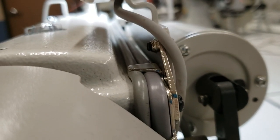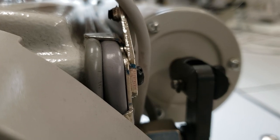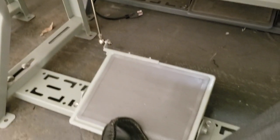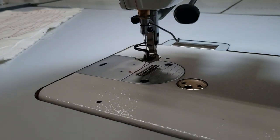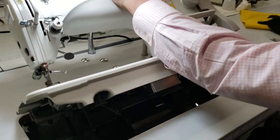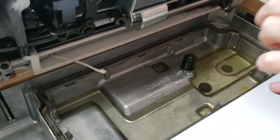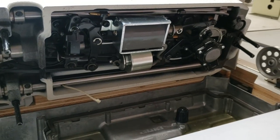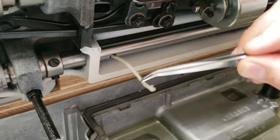When I put my feet on the pedal, that pretty much lifts the foot lifter — that's what you see. So it's very simple: when you want to lift the feet, you just go up and that's what happens. That's the automatic foot lifter. You have the oil pan right here, the oil pump here, and all of the stuff right here is for the foot lifter, knee lifter, and thread cutter.